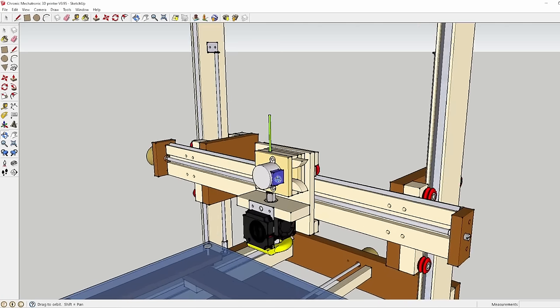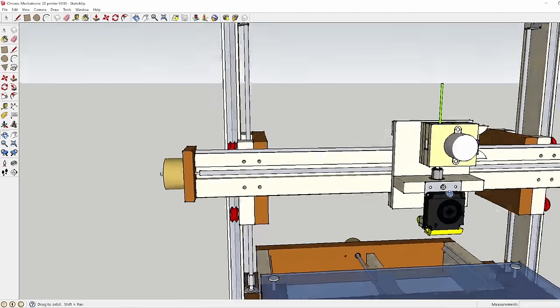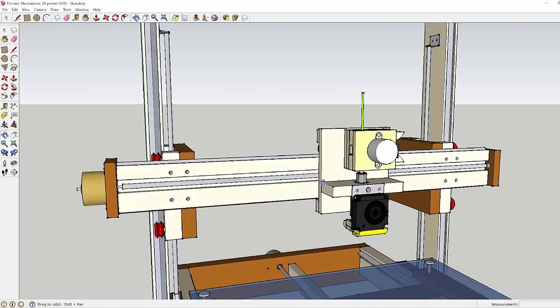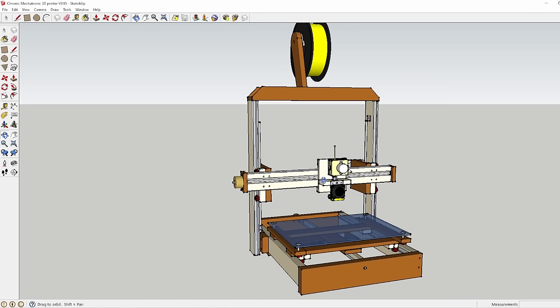You can see the extruder is attached to the hot end, and we have the motor on the x-axis pushing the carriage via the lead screw. If I can get my hands on one, it'll be an imperial size because of the coarser thread, so as not to make it super slow. Higher pitch always needing less turns to advance the nut a certain amount.